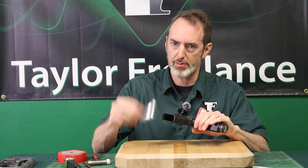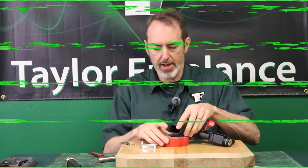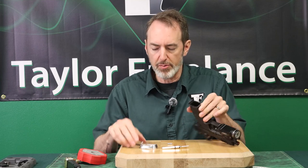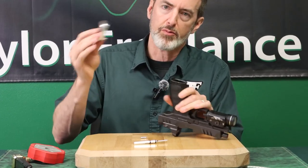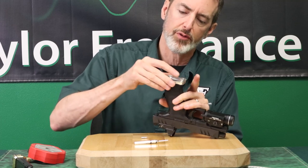The first part is obvious — it's retained by the roll pin for the grips, so you've got to get that out. Once you have the pin out, you have to come from the back to the front, hook part first, and then you'll have sufficient clearance to get around the nose.